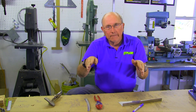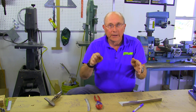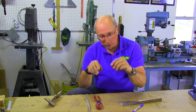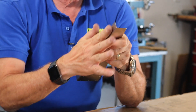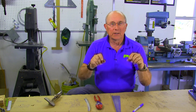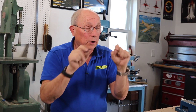Then up comes the topic of shims. Sometimes you'll have a skin that's supposed to fit perfectly on a rib and there's a little gap, or a fuselage skin which has to fit over a set of formers or bulkheads and the skin is a millimeter too long — so at one point there'll be just a little bit of a gap. You can fill that with a shim, generally because it's just a flange, and you'll want to sometimes take that shim and taper it. Use a piece of aluminum — common 0.032 or whatever thickness is required — and you can taper the shims with your disc sander so that you go from a place where you need the shim to a place where you don't, and it'll fit and take up that space. What you don't want to do is let the rivets pull the pieces together and have a pillow between them, because that's a bad fit — it's not going to be good for the structure and it's not going to look good either.